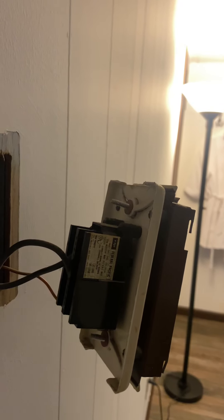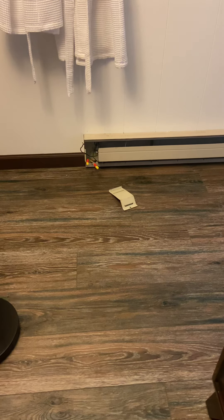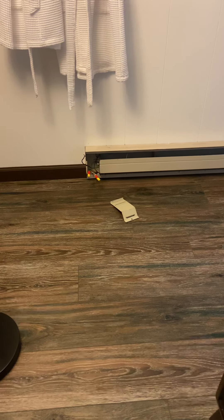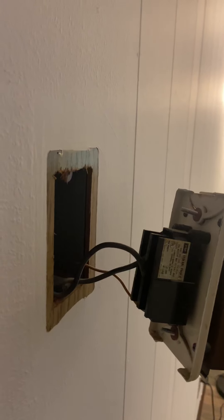Make sure you work safely — I'm not telling you how to do it, I'm just showing you how I do it. Make sure you have the power off and know how all the connections are done. If you don't know which is the line and which is the load, what you can do is disconnect all the wires once the power is off, disconnect the lines on the radiator too, cap them off with wire nuts, then turn the power back on and see which of the two wires is the hot wire — that's your line.